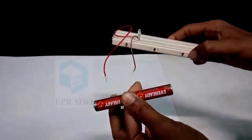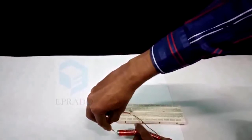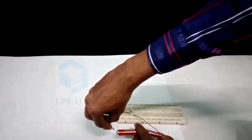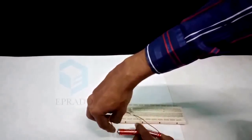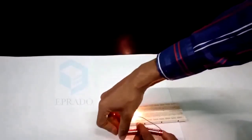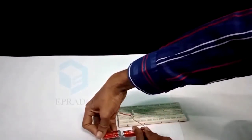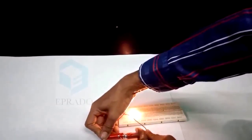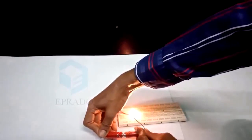We have to connect these two wires to the positive and negative terminals. Can you watch it now? The light is glowing now. If we provide 3V to this LED, then this LED is glowing. I have connected the positive terminal to the positive terminal of this battery, and the negative terminal of the LED to the negative terminal of another battery. The positive terminal and negative terminal of these two batteries are connected together — this is a serial connection. In this connection, the voltage is added: 1.5V battery is connected to another 1.5V battery in order to provide 3V.